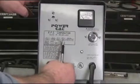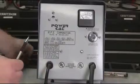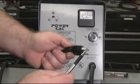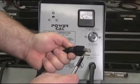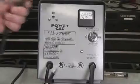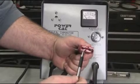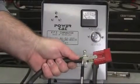When inspecting your battery charger, check the AC plug to make sure that it is in proper working order. Pay close attention to the ground plug terminal, that it is in good condition as well. Also, check the red Anderson plug. Check that the Anderson terminals are not worn or damaged. If any sign of damage is shown, replace the plug accordingly.